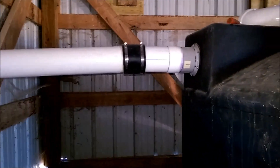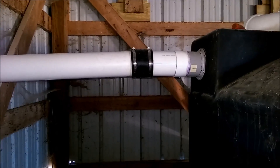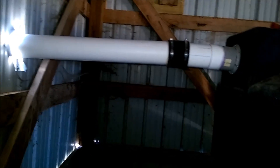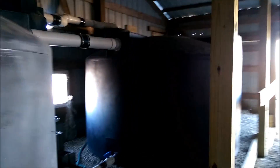This is the overflow system. The water fills up both tanks, and when the tanks can't take anymore the water starts coming out of here. There's a slight slope that takes it right outside. We're collecting the extra water because obviously we want to keep as much as we can, but of course there comes a point where we just can't keep anymore.